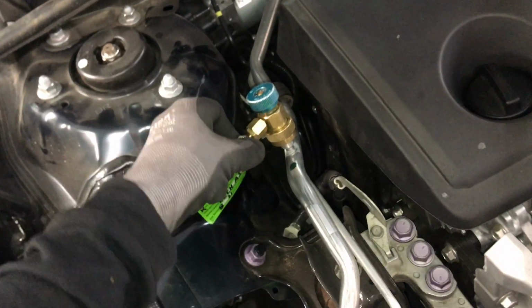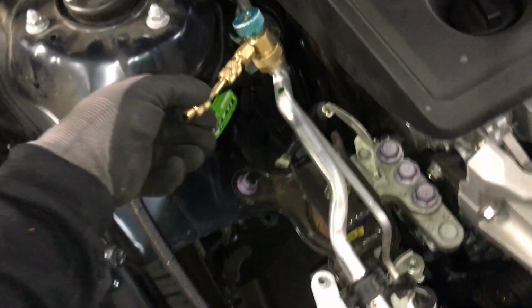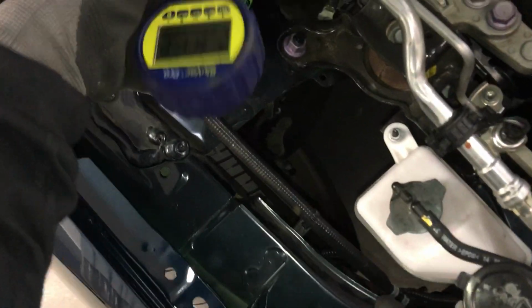Now say I had a 5-ton condenser and evaporator on a residential, and I wanted the cheapest method to get the best system. Well, all you've got to do is invest in one good hose to one vacuum pump and put it on one side, and you'll get a good result. It'll take just a tad bit longer.